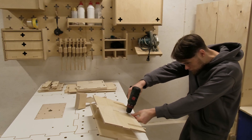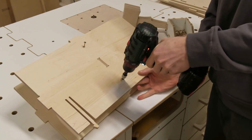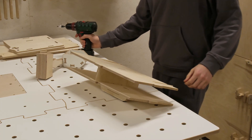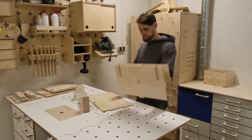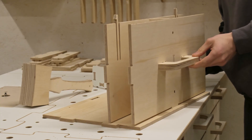The wall will serve as a divider for the shelf compartments. Again we have to secure these parts together before the next steps, as later the screw holes won't be accessible. Now we can add the assembly to the toolbox pack — simple tenon joints help us align everything.